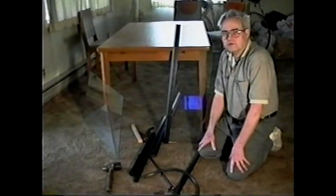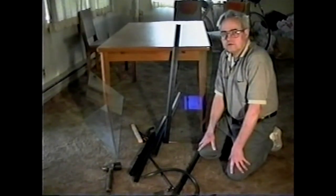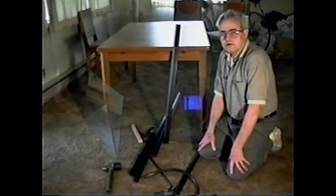So if you build a plastic windshield, be prepared to be very careful and have a supply of water to wash it down with, and a soft cloth. And also, when you're underway, you should either be seated high enough to just see over the edge of a plastic windshield, or be able to raise your head so you can see over it. But with a glass windshield, you can fully enclose the craft, and with the wiper, you can see where you're going. So it's a much more desirable situation.